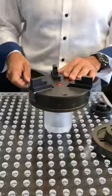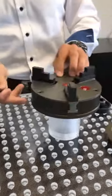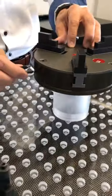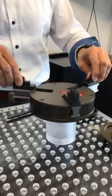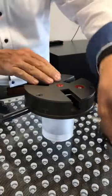The very interesting concept of this new chuck is that we have a work position and an open position to reduce the changeover time from inner to outer clamping. To switch, we open the chuck, put two levers in here, open the chuck fully, and take the three jaws out — one, two, three.